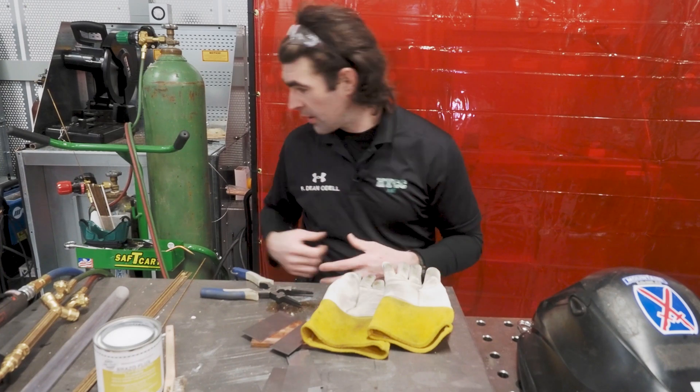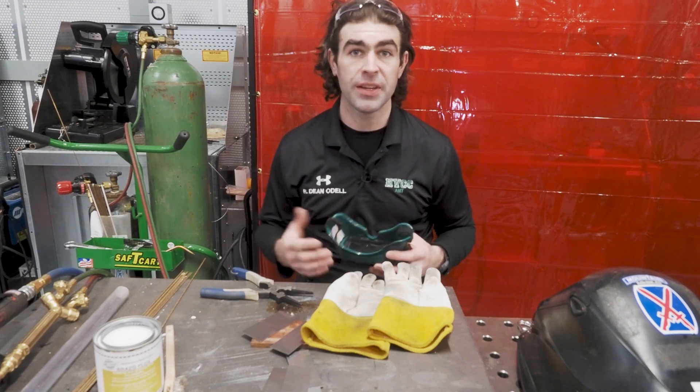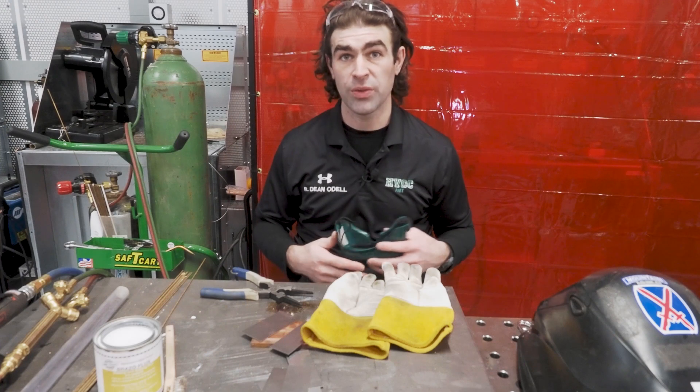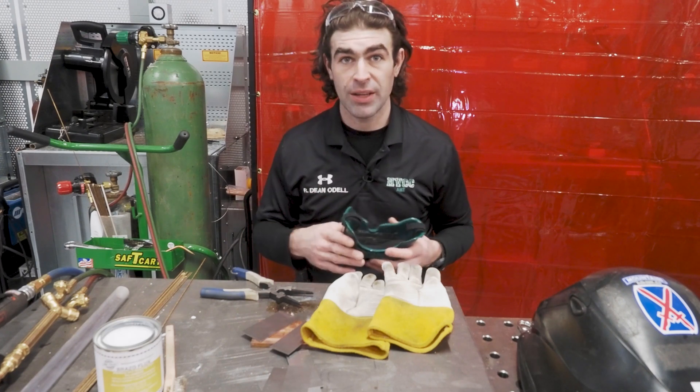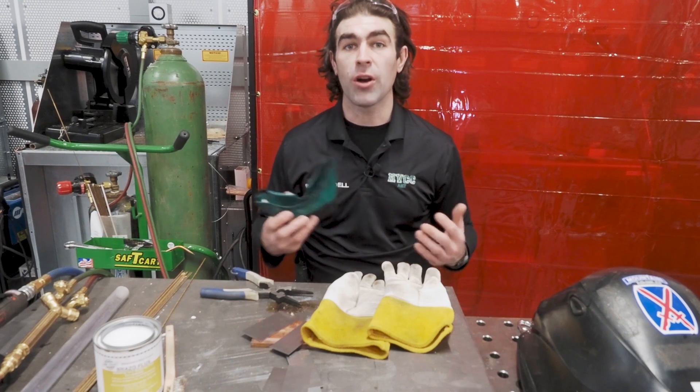As far as safety is concerned, I have on long sleeves, gloves, safety glasses, and a welding helmet. It's possible to do brazing with just welding goggles, but I don't prefer it because occasionally some hot splatter or metal will jump up and hit you in the face — I like the full face shield. I'll use about a number five darkness on my screen. You don't want to use a normal welding shield because it's too dark and you won't be able to see what you're doing. Gas welding and gas brazing are not nearly as bright as arc welding.